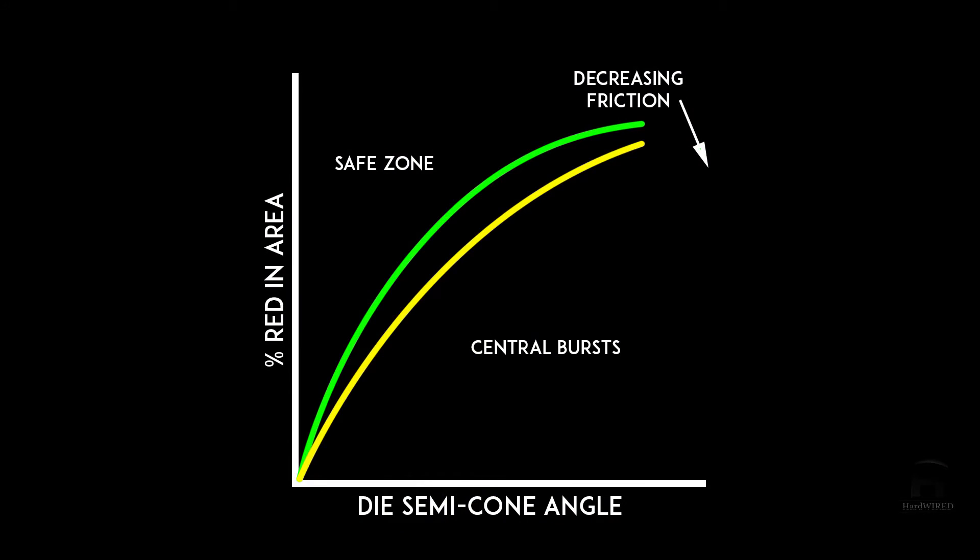Many years ago, people calculated the cause of this problem. They found that if you have too large a die angle and too small a reduction in area, you get extremely high tensile stresses in the center of the wire, which may cause a crack. A crack begins and nucleates in the center of the wire. When the stresses are greatest on the shear plane — a 45-degree plane — and 45 degrees in three dimensions becomes the surface of a cone. That's what happens.